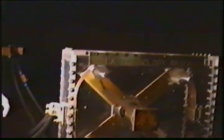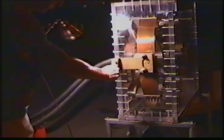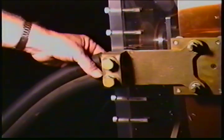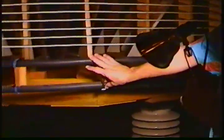This is how the rotary gap is connected. The stationary electrodes here and here are connected by 4 inch wide copper strap inside, feeding through to a brass plate that is 3 inches by 4 inches, coming out to these two cables. My fist is about 4.5 inches across to give you a size reference — this is 500 MCM, that is 500,000 circular mil cable, and there are two in parallel. This brass plate is 3/8 of an inch thick. This makes one connection to one side of the primary coil — a single turn primary, 12 feet in diameter, with two individual turns connected in parallel.